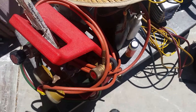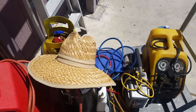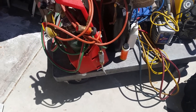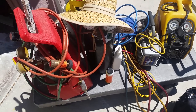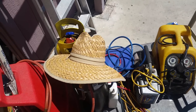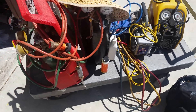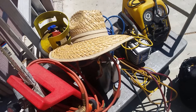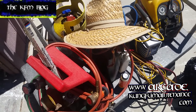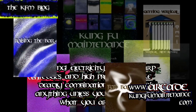Lots of fun. You have to get all the stuff up on the roof, and then all the stuff off the roof after it's done, plus the refrigerant and the compressor. Got my gauges in the blue case, and we'll also need some channel locks. You'll also want to add a new filter dryer, because the filter dryer can help absorb moisture. Vacuuming will get most of it, but if there is a tiny bit left, the filter dryer can help protect the compressor.